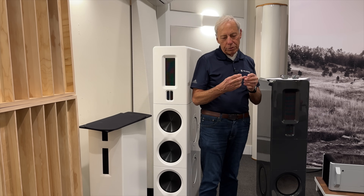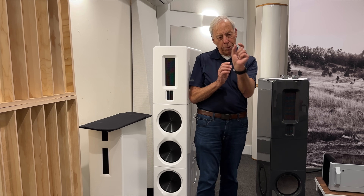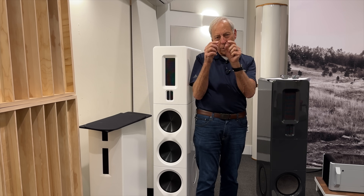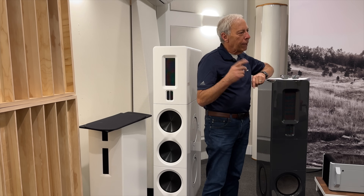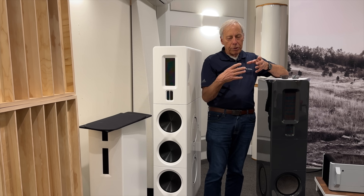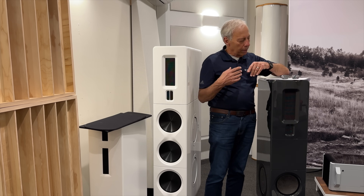So we do it using something kind of like radio waves — electromagnetic signals that jump across a pretty thin, small gap, maybe that far. A little radio transmitter and receiver on each side that goes between the two. It's very low powered, probably doesn't go more than a quarter of an inch. That's number one. Then we have separate power supplies: the output stage has its own power supply and ground, and the input stage has its own power supply and ground. That disconnects any kind of ground noise in the Air Lens.